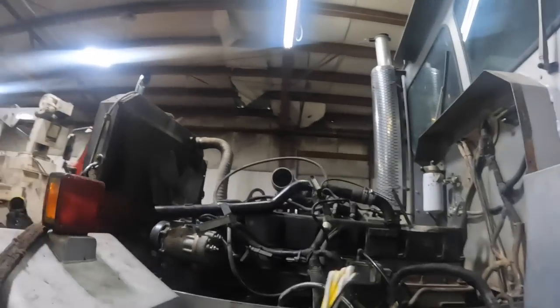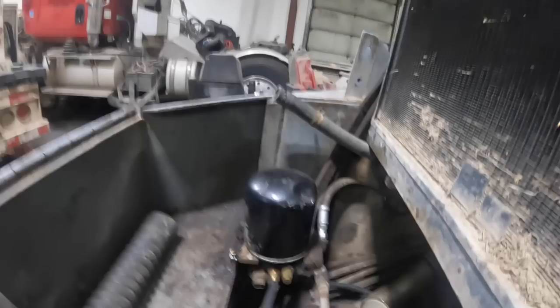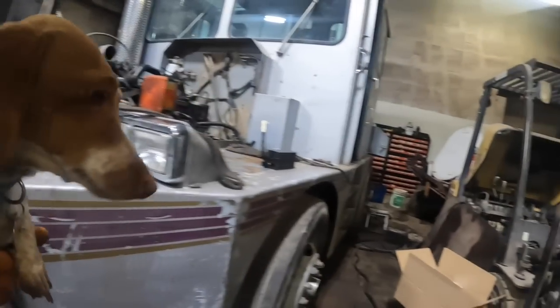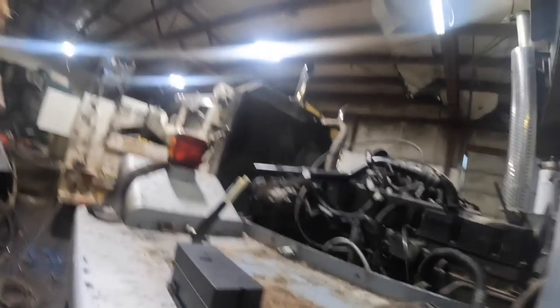Me and Lulu were trying to figure this out. So anyways, I plumbed the air dryer — got that plumbed. Got the actual purge line plumbed and the reservoir line plumbed to the air governor. Let me show you where I'm at here. I'll turn my headlight on, which is hard to do with a wiener dog. I got batteries in it and got everything there. Anyways, it's got a fuse panel with six relays.